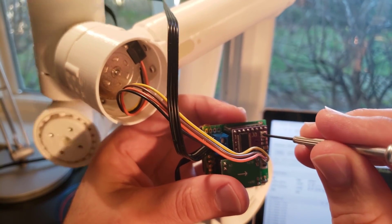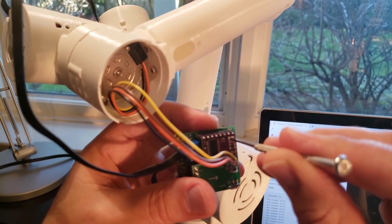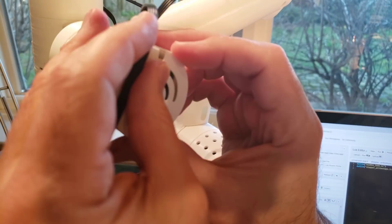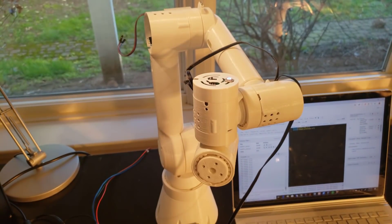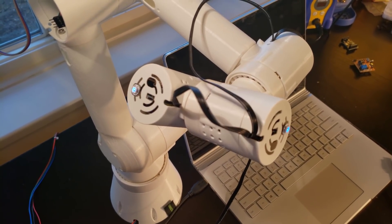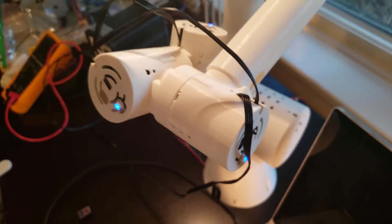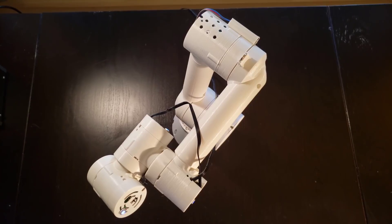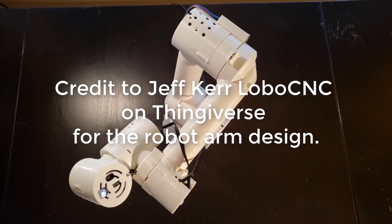I'm using the ESP32 LUA workspace in Chili Pepper as well, so I'm milling from Chili Pepper and programming from Chili Pepper — pretty cool. Here I'm adjusting the current on the stepper driver, because those motors only run at about 250 milliamps and the driver can pump out one and a half to two amps, so you've got to dial that in. I've got the switch on all three and I'm running test code that goes back and forth. The sound is a little harsh, so I do need to tweak the code to get the stepper movements smoother, but all in all looking pretty good. Next step is the other actuators and their electronics, and then driving it all from Chili Pepper with its own workspace. Thanks for watching.